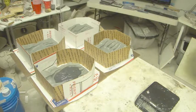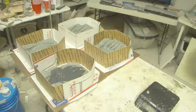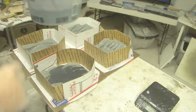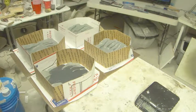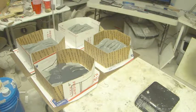and you want to make sure that it's in the same area. You don't want to move the silicone all around the place, because if you move it all around the place, you can trap air. Whereas if you make sure it's always in the same spot, then it will flow through and make sure that it's evenly sort of filled up everything as you go.